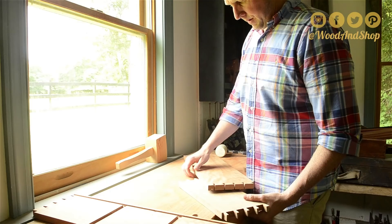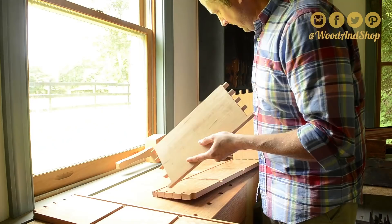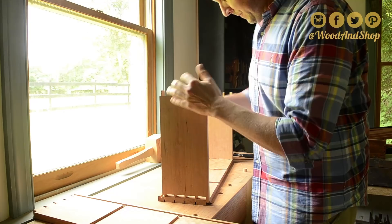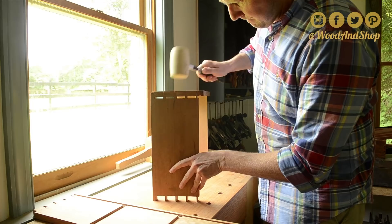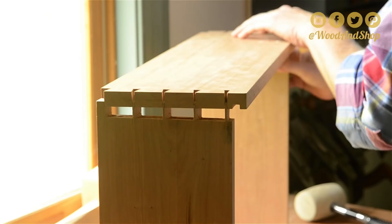This particular wall cupboard fits together with hand-cut dovetails, and that forms the carcass or the case of the wall cupboard. You shouldn't have to give much more pressure than just hand pressure or maybe a little light tapping. Here's a close-up shot to show you how the tails fit onto the pins. You can see by my thumb that there's a groove going through as well, and that accepts the back of the cupboard, which you'll see in a little bit.